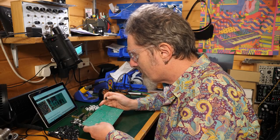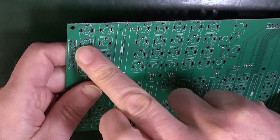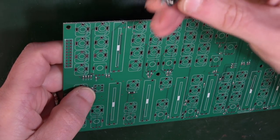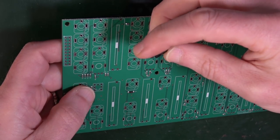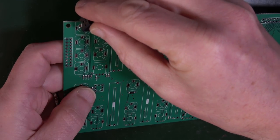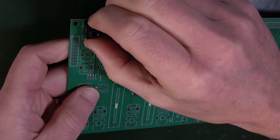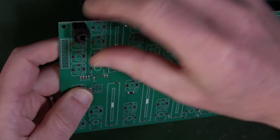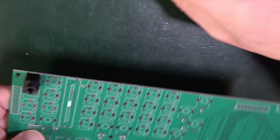46. Right, okay. So if you look at the board, you'll see you've got three connections, and if you look on your adapter here, you've got three legs, two and then a one. So these are simply going to go in there. Now, do they push in? Yes, they do, and they hold nicely. So that's the answer, is that they all go in, and you're going to be able to turn it over and solder it without them falling out.